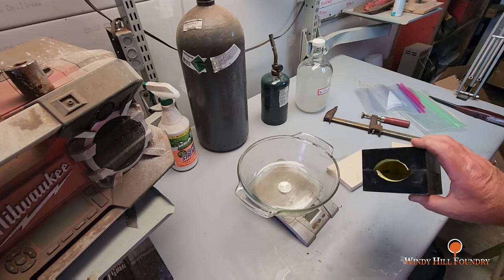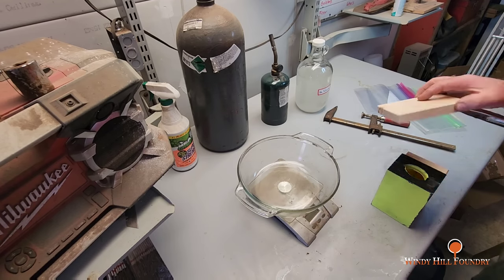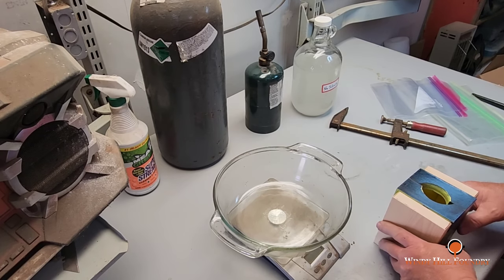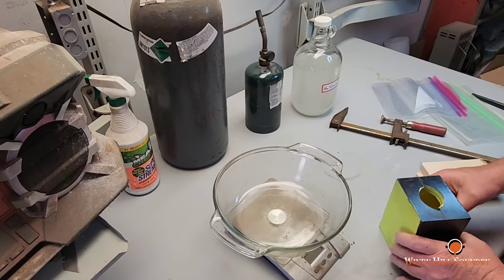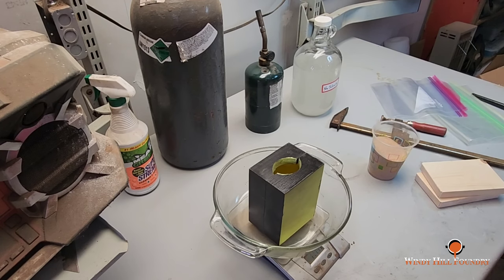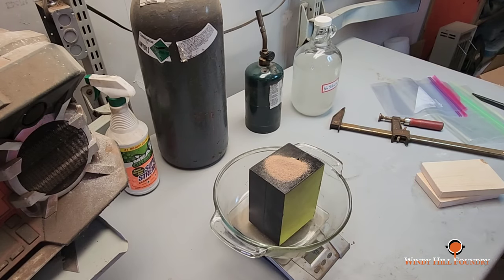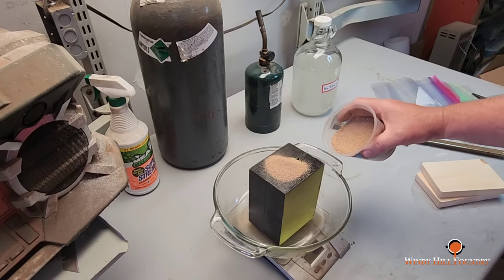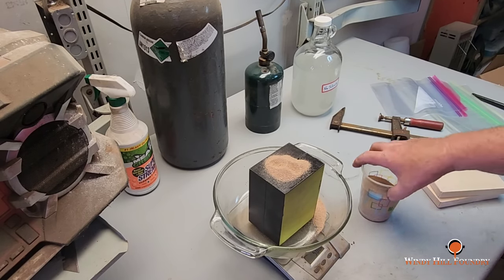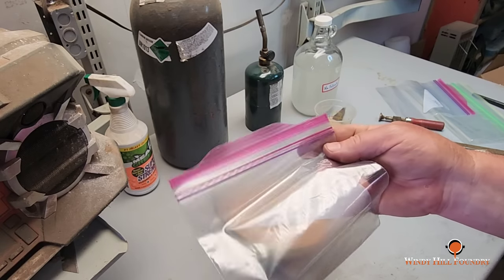Every single thing we do has a purpose. We're going to start off with the core box, which I showed you earlier — we went ahead and made a round area up top. I've got two one-by-fours and I'm going to clamp on each side of this; if you were to put the pressure of the clamp right here it's possibly going to flex it in, where this will evenly distribute the area. At this point we just need to measure and see how much sand we're going to have to put in it. We're looking at 487 grams and I'm just going to round it off to 500 — 500 grams even for this size.